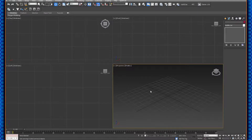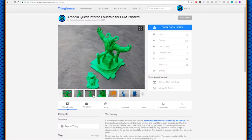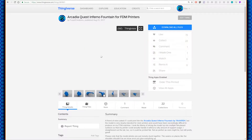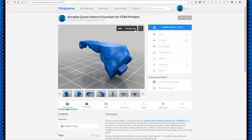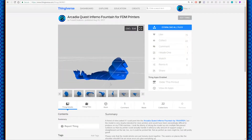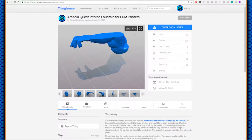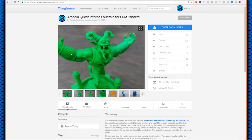Someone was asking me earlier today how I sliced some models up for 3D printing — specifically this model I published on Thingiverse, which is a tabletop statue I sliced for FDM printers. It was initially designed for SLA or resin printers. FDM printers use a flat print bed and build up from it, so you want flat planes you can lay down against the bed and build up from. The idea was to cut the model into parts I could print separately and then super glue together.